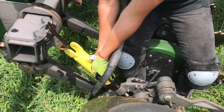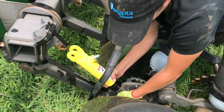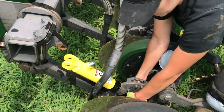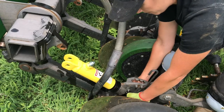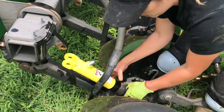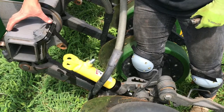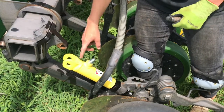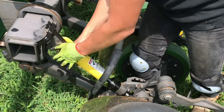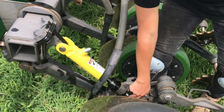Slide this through. Make sure your rock shaft is torqued all the way over, and that way your cylinders can reach up. Put the pin through, and then punch your roll pin through. Then come back through with an impact wrench and tighten this nut up.